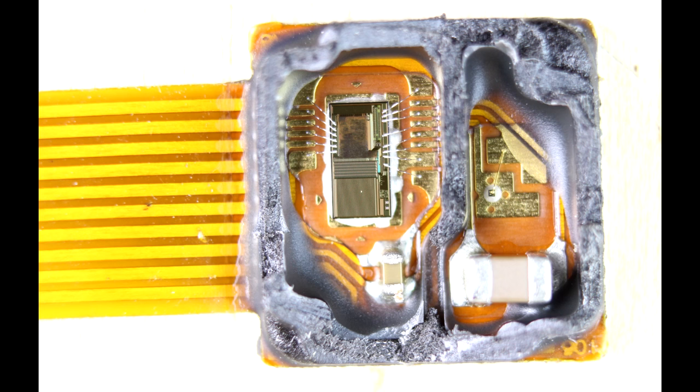Let's snip off that top plastic and take a look at the assembly. There are two components. The first is a laser — it's rather small, so I have it highlighted here on the right-hand side where the arrow is pointing. It's a laser mouse, which means this is an IR laser — a super small die. It makes sense because a mouse has to be eye safe, meaning if you look straight into it, it doesn't damage your eye. That implies very little optical energy, which would translate into a little tiny die.